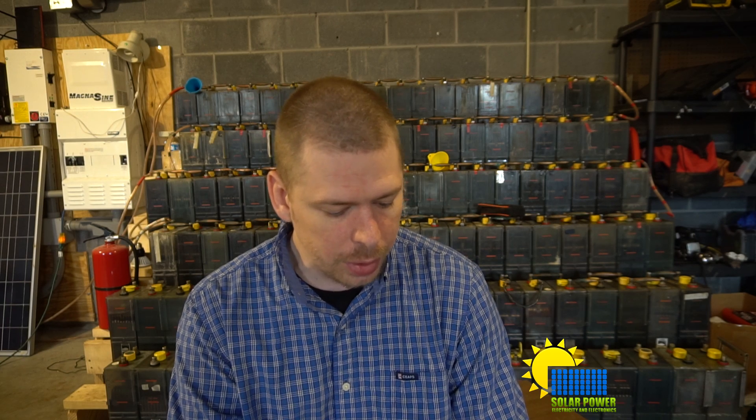Batteries need to be cooled as well as warmed up, so not leaving ample space between cells for cooling is a problem. Leave at least one inch between cells for cooling — ask the manufacturer what they recommend. Midnight Classic says one inch. If you've got a lot of charging power, you definitely want to separate them. Mine are separated now.